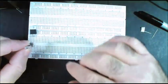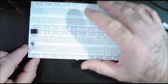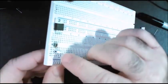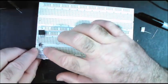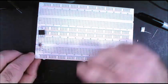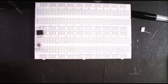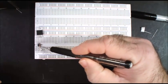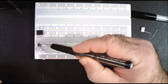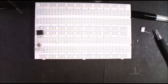This LED is going to go right here with the black stripe going in at position 3 — that's the minus side — and the plus side of the LED going into 4. The next thing we're going to do is take a red jumper to complete the circuit. We're going to go from 4F to 4E, and that turns out to be a jumper about 9 holes long.